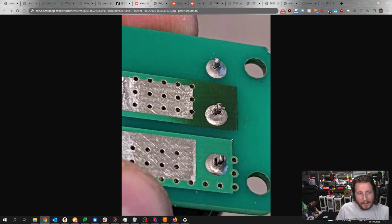This is a fun problem. Not exactly a print fail, but a fail nonetheless. And he is a patron of ours, and he put it in the channel. So I thought that we could take a look at this. This is on a 5-year-old 3D printer. These are cracked solder joints, and he was having issues with intermittent failure of the heating systems. We got a bit of a problem here, but we also got a little toasty. And I don't know, of course, what's on the other side of the board, but given how large these connections are, I'm guessing it's power plug.